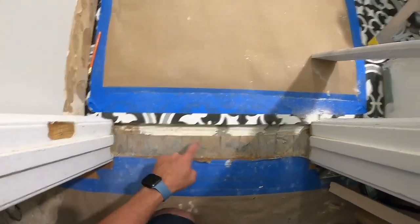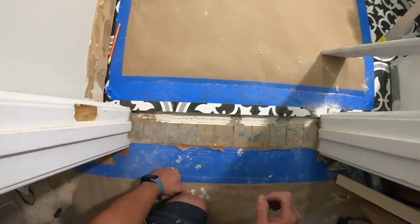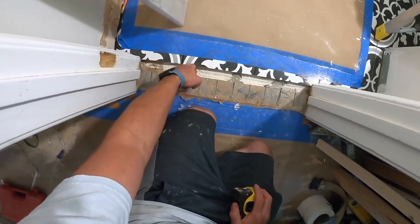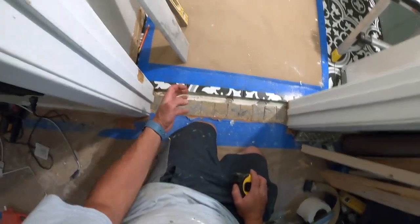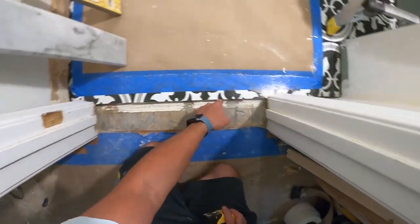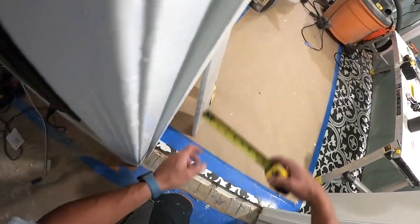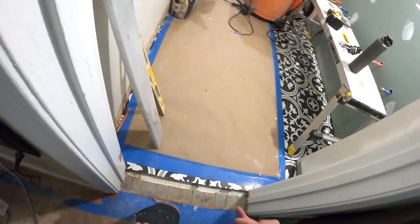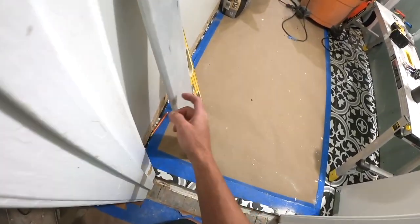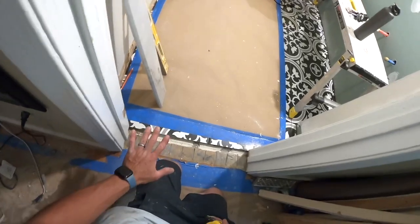The next step is to measure how wide the threshold is and cut back the three-quarter inch finished oak flooring. I do not put cement board all the way to the jamb — I build up the bottom with mortar. Also, I run my cement board or substrate the same way — don't run it past the jamb. If you're using Schluter, make sure you get a three-quarter inch threshold, because the five-quarter stuff from Home Depot will give you a step. This piece I got from my tile supply house is around three-quarters of an inch, so I have room to work.